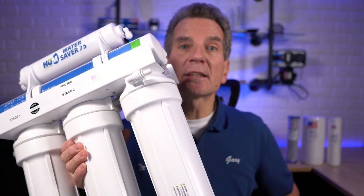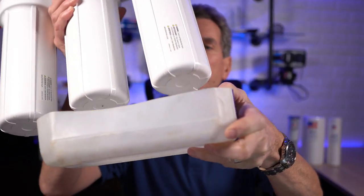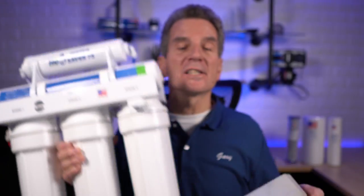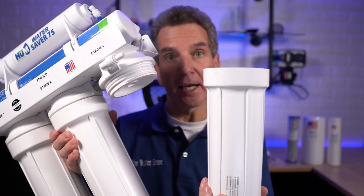Before you go any further, make sure you've protected the area underneath the kitchen sink — or wherever you're doing the work. Put down a fairly large towel because there will be some water spilled. I find using a container — like the bottom of an old water jug — placed underneath the filter housings works well, so that as you unscrew them the water gets caught in the dish. Once you've unscrewed the filter housings, you'll find the filter inside. Carefully move it over to the sink or a pail to dump out the water. I always recommend doing one filter at a time because there are different kinds of filters in those housings and you don't want to mix them up.